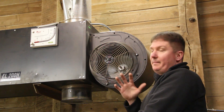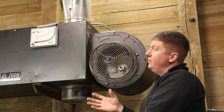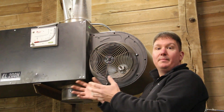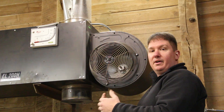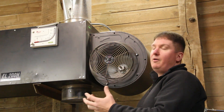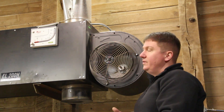The fan will come on and off based on the temperature of the heat exchanger. When the unit first starts up the fan will kick on slowly, might turn off to allow it to build more heat, and then as the unit turns off and starts to cool down, the fan might turn off, the heat exchanger builds heat, and then the fan turns on again. It's all based around trying to get the most heat out of the least fuel.